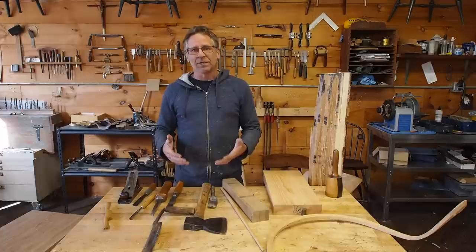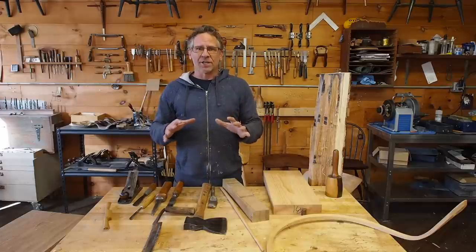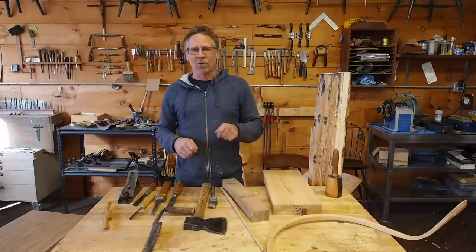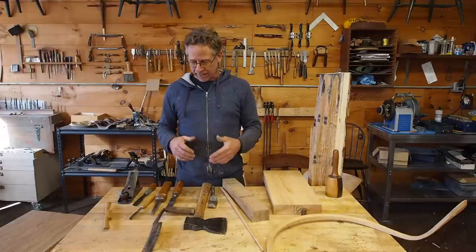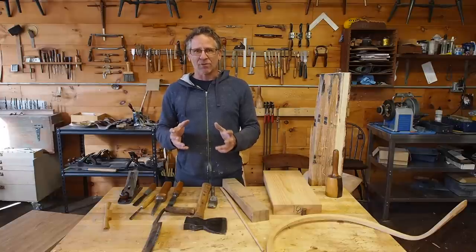So what we do to toughen this stuff up is we heat it to cherry hot. And when you heat it to cherry hot, it actually gets everything jiggling, and it forms a very tight, strong matrix. Everything snugs up really tight against each other, and then we freeze it in that position by quenching it. So you quench it in some sort of a medium like oil or water, depending on what it is, sometimes air. And when you do that, it makes it rock hard all of a sudden, but there's a lot of tension built into it. If you left it in that state, it would start to sort of micro crack and degrade over time because that tension couldn't be sustained.